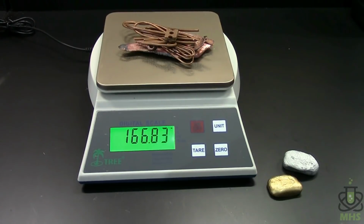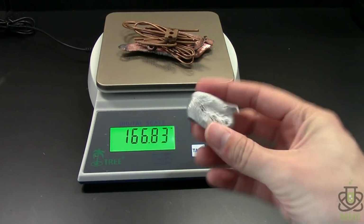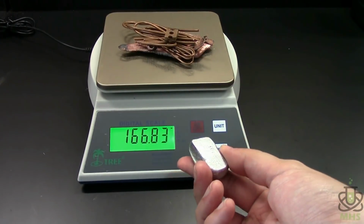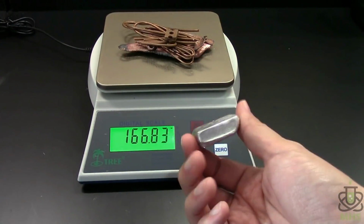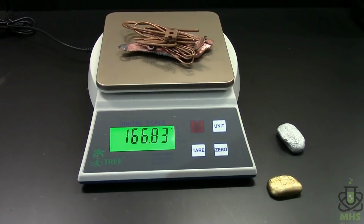This time around, when I'm making the new stuff, is gonna be somewhat of a test because this is a bit lower purity ingredients. So this aluminum ingot is from soda cans. So a bit less, it's still fairly pure aluminum as far as alloys go, but less pure than wire. And these bits and pieces, there is some wire, but some of it was melted from copper pipes, which doesn't have to be as pure as wire either. So we're gonna melt these together and see if they produce as nice of a color as the very pure ingredients did.